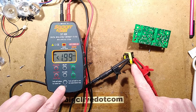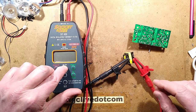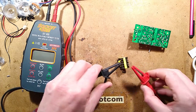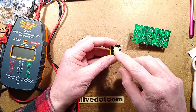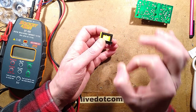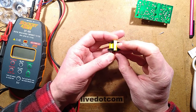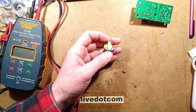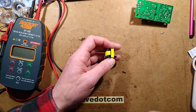You can hear it fizzing inside. To narrow it down initially, I actually used the thermal imaging camera while I left it on the high voltage tester to arc. So this has broken down. I have to say that when you get a transformer like this, all it takes is that tiniest little spark across. As soon as the insulation is broken down, that's it, screwed, because it will continue to arc across at that point. This is a very ferocious image. I shall tame it down just a little tad.